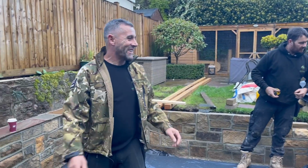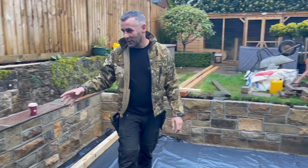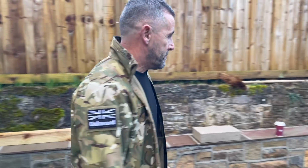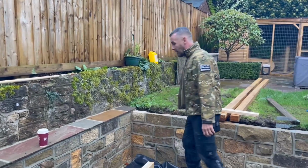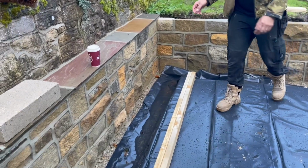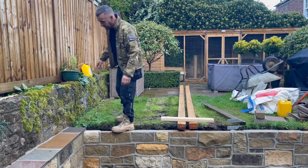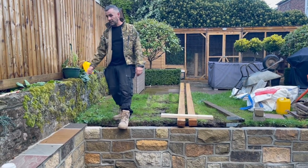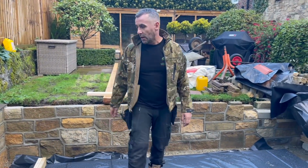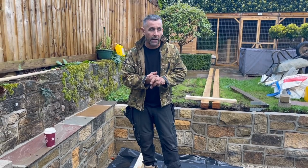Right, we're in Collingham in Leeds, North Leeds. John's already come and done this base. What the customer's done, let me just turn this radio off, because YouTube don't like that. You can see the land level, that was the height of the land. So he's had this full area dug out, which means we can build this above the 2.5, because your 2.5 is taken from your highest point of land adjacent to the building. The building will be taller than normal because it's going to be a gym and we need the internal head height. So the internal head height is going to be 2.5 maximum.